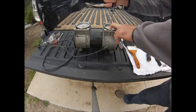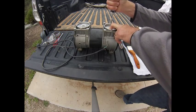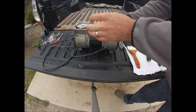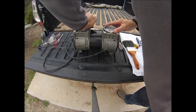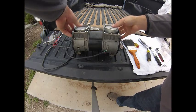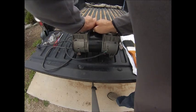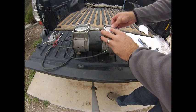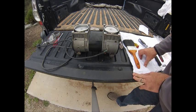This calls for 100 inch-pounds of torque. I'm doing it by feel because I've rebuilt about a thousand of these, but I'd recommend using a torque wrench if you've never done it before. When this part is complete, make sure that the pistons are in between strokes. Sometimes with the new cup seals in there, it makes for a very tight squeeze and it makes it difficult for the compressor to restart if it's at the top of its stroke.